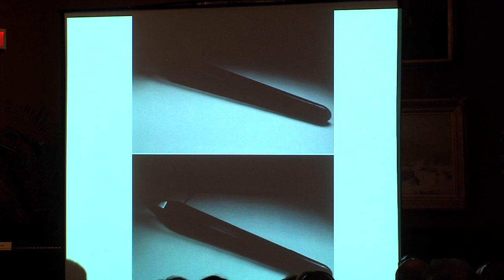But a professor there told me of a method of coopering, which is a method of barrel making. With this method, you have several staves of wood, and you cut them at a specific taper and an angle. And when you put them together, they achieve a compound geometry. In a way, it's a superficial way of achieving a compound curve. You get the same geometric strength of a compound curve without the necessity to stretch a material.